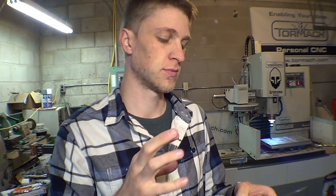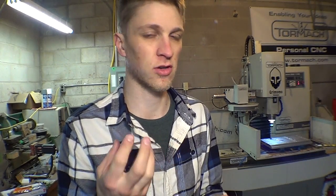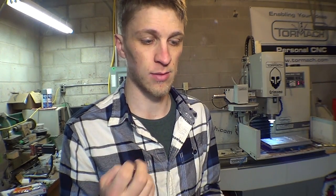So how do we fix that? Carbidizing. But there are tricks, and I'm going to show you some of my tricks to eliminate stickage even with carbidizing. Alright, so carbidizing puts a layer of carbide, tungsten carbide, on the end of the lock face. And not only does it help prevent stickage, but since carbide is so hard, it also improves the length and the wear time of the titanium lock face. It'll help it last longer, theoretically.